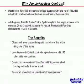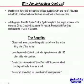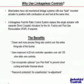The obvious answer to the limitations of linkage controls is to get rid of the linkage entirely — being linkageless. This means getting rid of that one foot-mounted actuator as seen in prior slides, and in cases where flue gas recirculation is required for NOx control, getting away from the linkage that can be somewhat tedious with that.